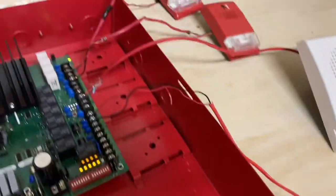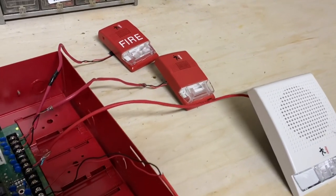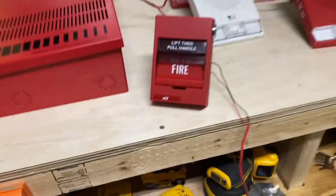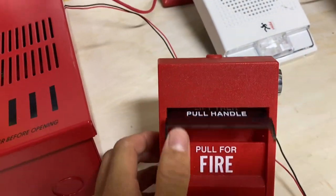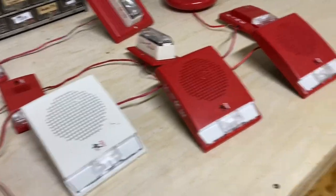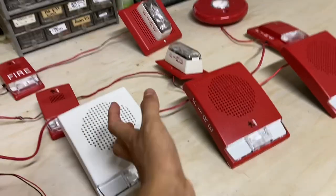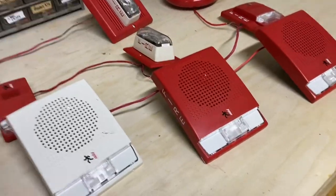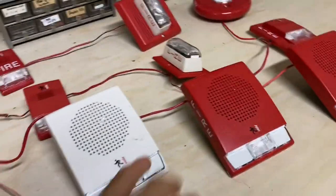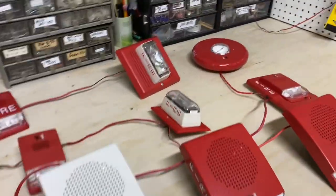Hopefully that is a somewhat okay explanation of how a fire alarm booster panel works. Now I'm going to go a little crazier and wire up a ton of other devices. I added a pull station to the trigger — all this does is basically switch the 24 volts. I also added a few devices, a couple of speaker strobes. Perhaps you could have a partially speaker-strobed building. Obviously this won't control the speakers, but it'll provide power for the strobes. So let's go ahead and pull it — this is going to be loud, these should all sync.